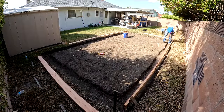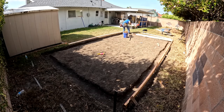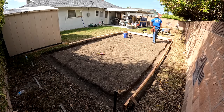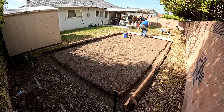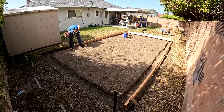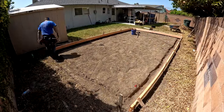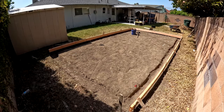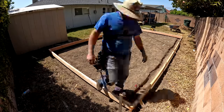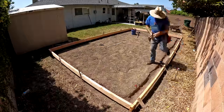As far as setting this up — I don't have my laser level because my Johnson got stolen, but I've got a new DeWalt on the way, so that's a nice upgrade. What I'm doing now is just paralleling the wall. I hung that form level using just a four-foot level and that's going to work for me. I didn't even have a square out here — after I set this long one parallel with the wall, I just six-eight-ten'd over there, swung it around to my string lines and squared it that way. Once I had those two, everything else was just measured off of those.